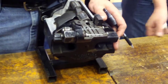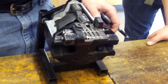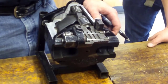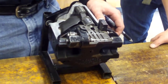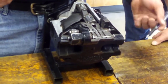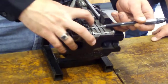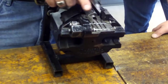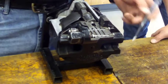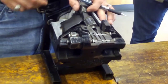Once we build up to 1,350 psi, the pump turns on. Let's say the pump output flow is way more than necessary for the function that needed 1,000 psi — say the pump is putting out twice as much flow. That means pressure is going to start building, and anything beyond 1,350 psi will shift the spool over and start de-stroking the pump. This spool is going to modulate back and forth so the pump output holds at 1,350 psi — only 350 psi more than what's necessary for that function. We're running very efficiently that way; that's a lot smarter than having a pump running at 4,000 psi all the time.